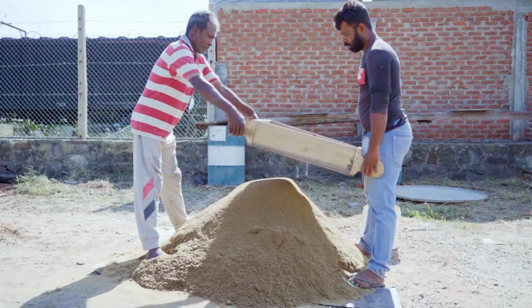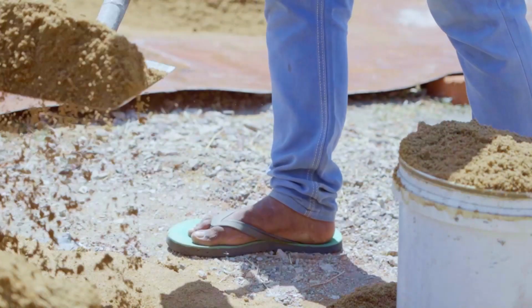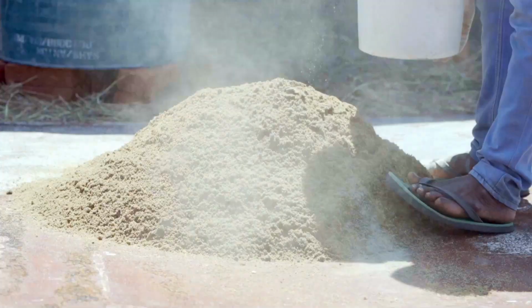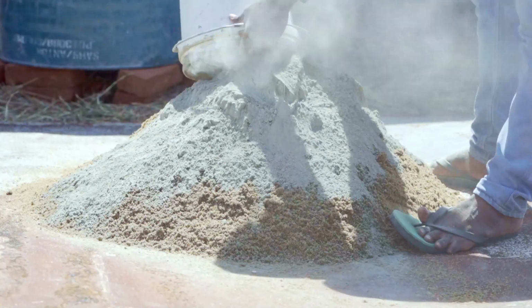While the quantity should be carefully measured, typically on work sites, they are eyeballed and measured with shovels and tachis. This leads to poorly mixed plaster with inconsistent quality, which further leads to a shortage of what is needed because it is difficult to account for loose materials. Inferior quality of material from different sources leads to breakages and cracks to appear on your brand new wall.